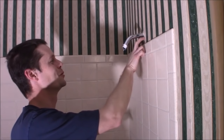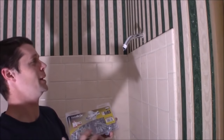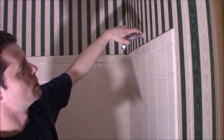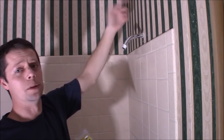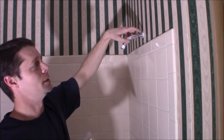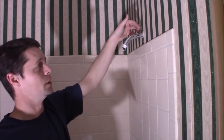So I'm going to get to work here. I've got four holes to drill to get this ready. I'm going to put in my drywall anchors - just some standard drywall anchors from the package. I'll drill a hole, put the plastic anchor in, get it ready to go, and have my JB Weld ready. Since this is smooth chrome and you're not going to see this piece back here, I'm going to take some emery cloth - which is like a fine 150-grit sandpaper, a thin strip you use for polishing automotive or mechanical stuff - and rough this up so that the JB Weld can stick.